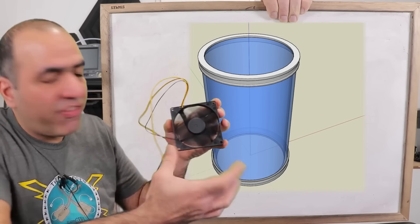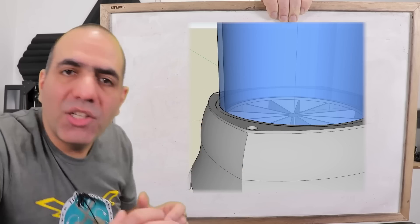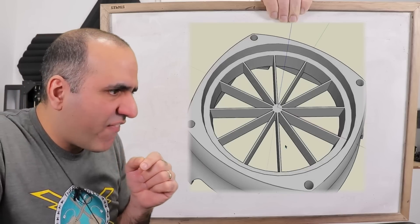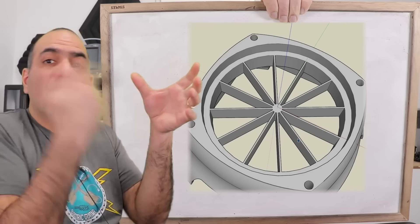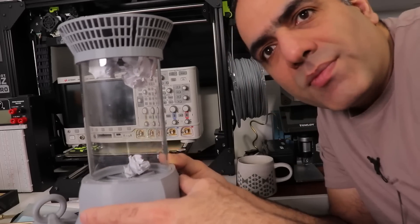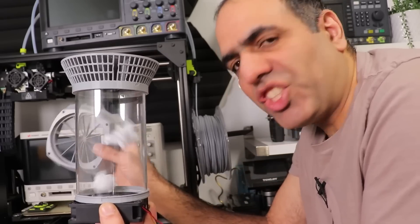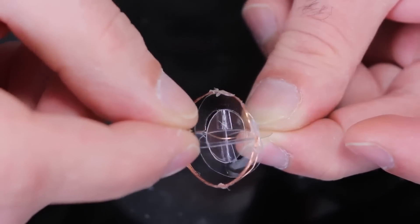The next part is designing the enclosure and managing the aerodynamics of everything inside it. An unmodified fan would just create vortices through the chamber, which would pin the flies to the sides of the lantern. So he printed up these fins to help straighten out the airflow from the fan. But they worked a little too well, since they just ended up getting stuck to the roof instead. He found that ball-shaped objects would tumble around better, so he used this shape for the fireflies.